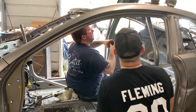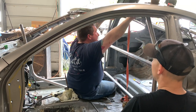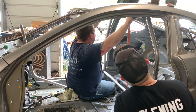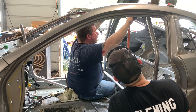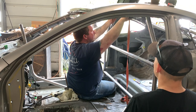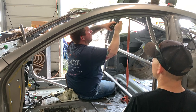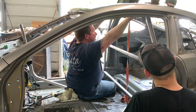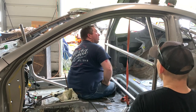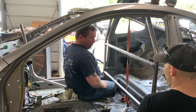How's it looking? Pretty close right there. Measuring — 15 and 5/8, 15 and 3/4. I think I'm good with that. So what I'm going to do is just tack it. We can always put a couple tacks here and here, and we can always move it up and down.